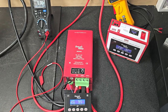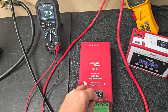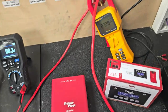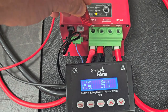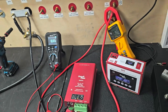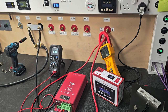This will work down to 39V on the input. At the moment I've got it set so there's a 56V alternator charging the donor batteries, putting in about 27-odd amps at 57.5V. If I drop that voltage down to, say, 44V — which would simulate quite an empty 48V battery — let me just drop that now.